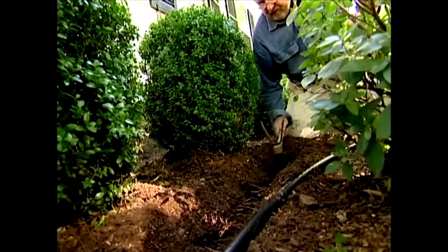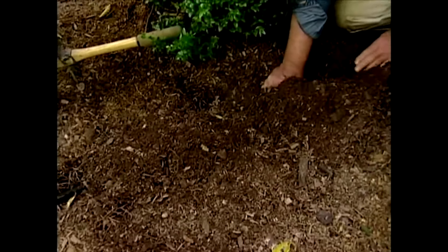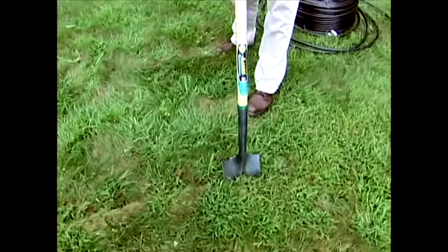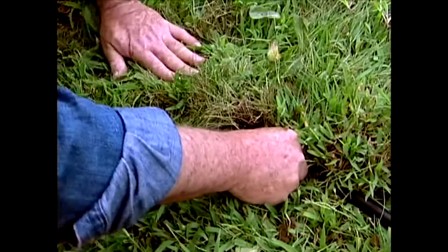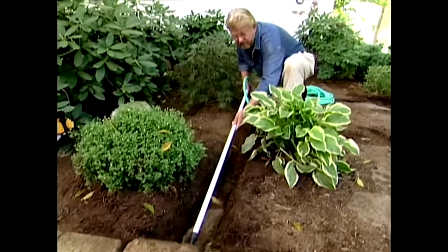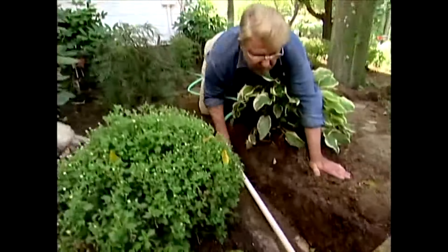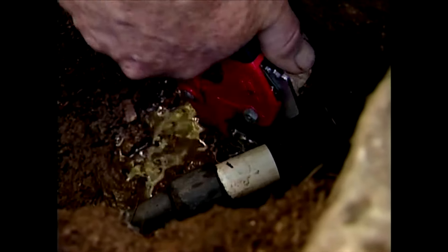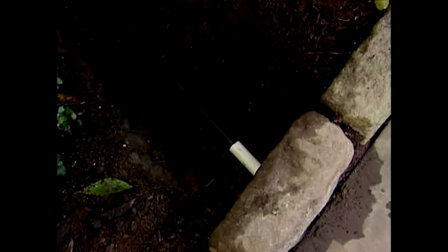The tubing can also be buried — usually a trench just a few inches deep is adequate. Since the line is not under pressure, freezing is usually not a concern. The simplest way to run tubing across grass is to make an angled cut through the turf using a flat garden spade, lever the sod upward to create a shallow groove, set the tubing in the bottom of the cut, and press the grass back into place. This is called a sidewalk tunneling tool — a plastic nozzle attached to a length of PVC pipe with a hose connected to the opposite end. The stream of water actually bores a hole under the sidewalk. Once through, I use PVC pipe cutters to snip off the nozzle and the hose connector — the plastic pipe stays in place and acts as a conduit, and I just push the irrigation tubing through it.